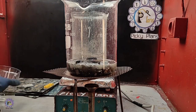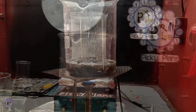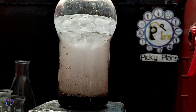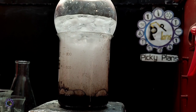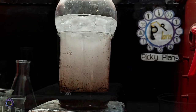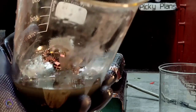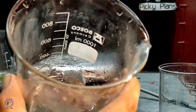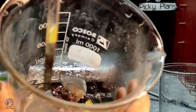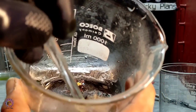All IC chips, transistors, and BGA chips that were separated from the motherboards were added to a beaker, with just enough concentrated sulfuric acid to cover the IC chips. I decided to transfer the beaker onto a hot plate and place an ice-filled round-bottom flask on top to condense all acid fumes. The wet ashing process took about one hour to complete — it's quite fast for BGA chips but really takes time to dissolve plastic on the transistors.